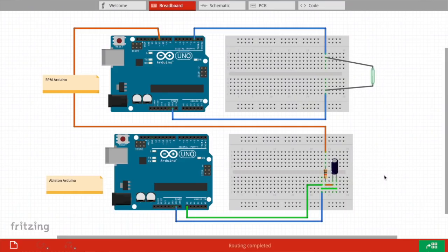Let's go over the full circuit for this project to show you how everything hooks up. We have our simple reed switch circuit from before, but now we've added a new circuit for smoothing out our PWM signal. I take the PWM signal representing our analog RPM signal and run that through a resistor-capacitor circuit. I used a 10k ohm resistor and a 47 microfarad capacitor, but you can play around with the values. The orange wire corresponds to the PWM signal that has not yet been smoothed, and after the RC circuit we have green wiring representing the smooth analog RPM signal that we can plug into the A0 pin on the Arduino connected to Ableton. This smooth signal should be correctly interpreted by Ableton and we're good to go.